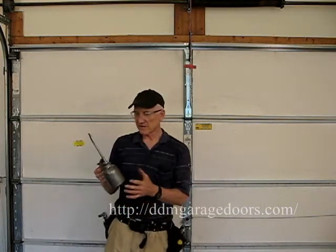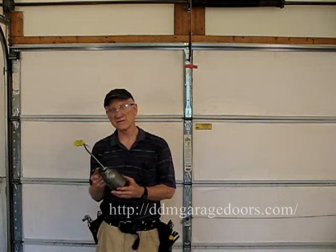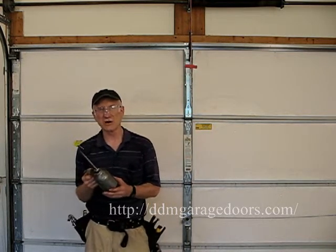Hi, I'm Dan Music, and today we're going to show you how to lubricate a garage door. What we recommend for oiling a garage door is probably the best oil is 40 weight non-detergent oil. You can pick this up at just about any auto parts store.